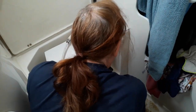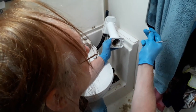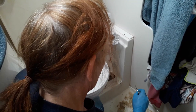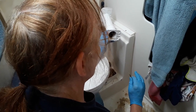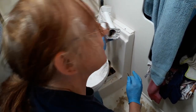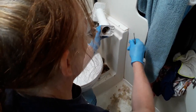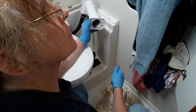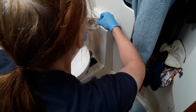What are you doing Bev behind all that hair? The toilet. We've had a bit of calcium build-up in it — anybody needs some calcium, let me know, I've got plenty to spare. It's not actually as bad a job as people make it out to be. I thoroughly flushed the system the other day, put some water purifier into it and cleaned it out, and there's actually very little smell in here. The deposits are all hard calcium — this is not poop. This is basically rock that has condensed out of seawater caused by a reaction with urine. It's coated the valves on the inside and I'm just taking it off.